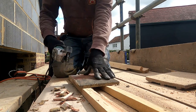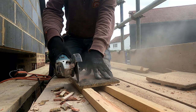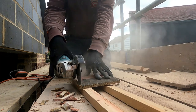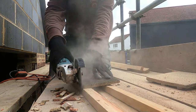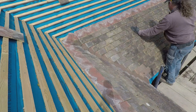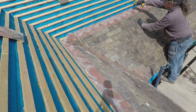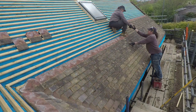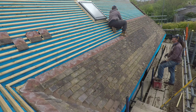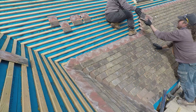So then we're off to the angle grinder, trimming off the edge. And there you go — looks lovely, doesn't it? The screws are in place. We've screwed down about every fifth row all the way along, screwing every tile just to stop them lifting in case there's strong winds. And then all the edges were screwed down, along with the tiles either side of the valleys.